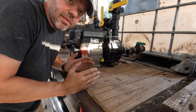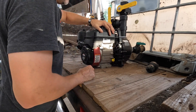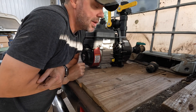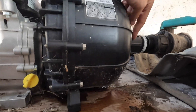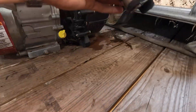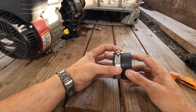They're the same height, so when I go to build a trailer I just build it all one height. Let me get you in here — these two are going to mate up. This is just the natural height of this pump and the natural height of that tank. I'm going to take this rubber coupler, cut this end off — it should give me a rubber union for these two. Get another hose clamp and we should have these mated together.